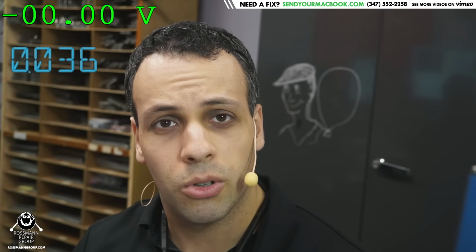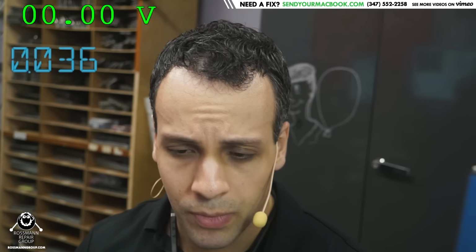As you can see over here, it's drawing 36 milliamps. Now, usually 22 milliamps is indicative of PM sleep S4L missing. 100 milliamps also has power grid issue. 200 milliamps short to ground on PP bus. 36 milliamps, I'm not quite sure.